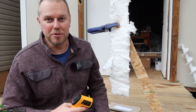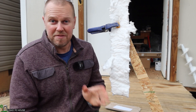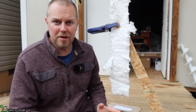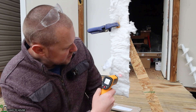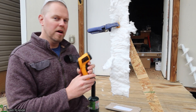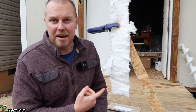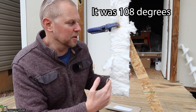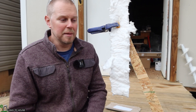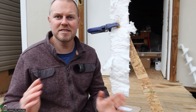I gave this thing about 10 minutes to cool off. This side over here never got above 108, and this side, when the fire was actually on it, it was about 1,000 degrees, and whenever I let it off, it quickly dropped back down to about 300 and then dropped back off. Now 15 minutes later — 52 degrees on the front, and back here, 49 degrees. It's about 47 degrees outside right now, so this thing cooled off very quickly, and the back never got above 100 with 1,000 over here. So definitely fireproof insulation. I just wanted to test this out because I put this on the corners of my wood stove, and I think it's going to do well to keep the heat away from the inside of the fireplace.